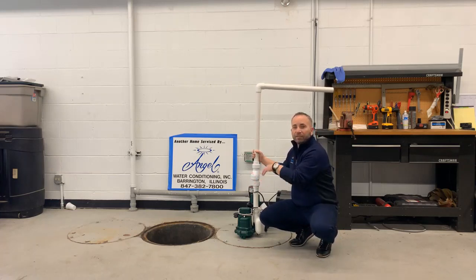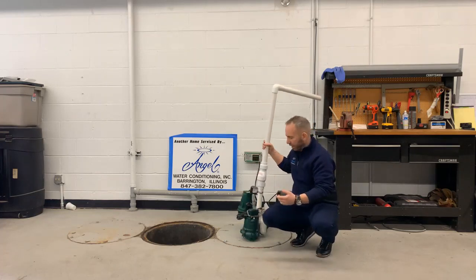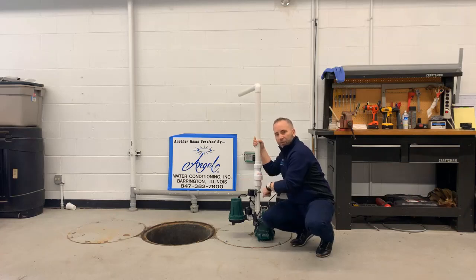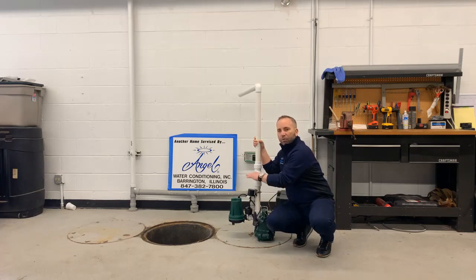If you live in Lake County or an area with heavy rainfall, it's worth replacing the pump every five years or so. If you don't know how old it is, it's probably time to replace it. If a house has two sump pumps, we'd want to rotate them every year or two — the primary is almost always the one running, so rotating may get a couple more years of life. That's what we do at Todd McCarthy's house; his flood was a great lesson.